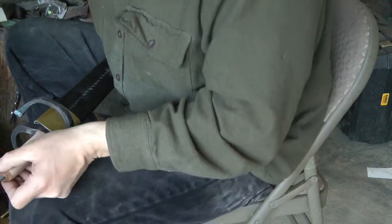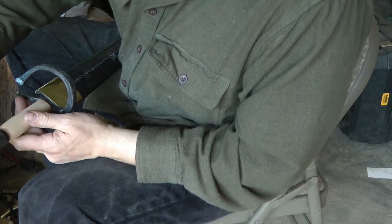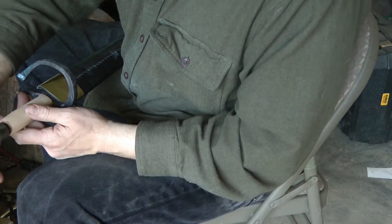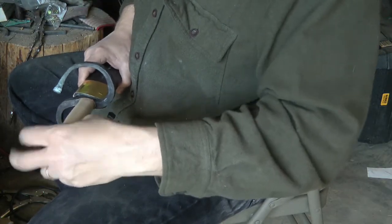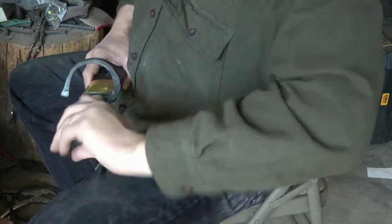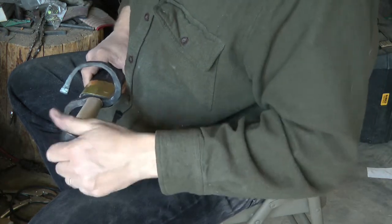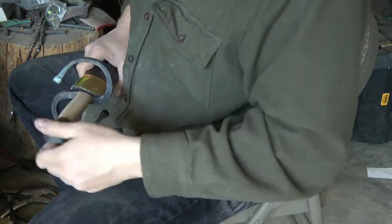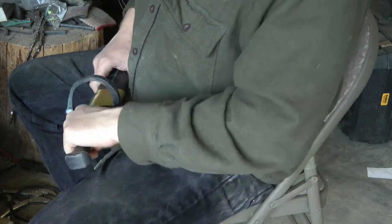Just trimming it in place. You can see everything is starting to come together. Unfortunately, since I just had the camera on a tripod, it doesn't quite show the pommel for most of this, but there I am really screwing it down. I threaded it as deep as I could get that tap to go, and I really cranked it on and it holds. It's a good solid handle now — feels good in the hand.